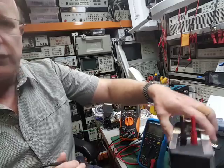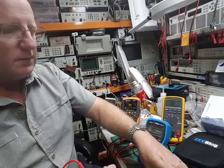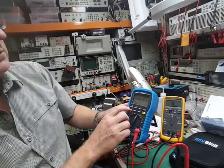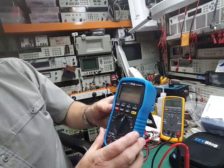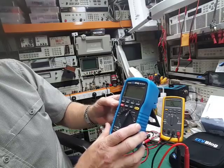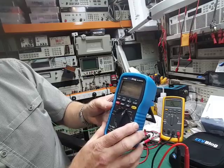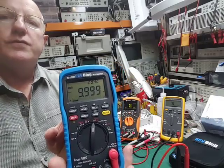The accuracy looks pretty good. I've got a nice Vishay Z201 resistor in here, and it's 10k to within, I think, 0.01%. I'll go back to the right mode. And it's making up its mind, but it's getting there. Yeah, I've got it in the right mode — that always goes better if you've got it in the right mode. And there we go, so that's certainly within the one count of the 10k resistor.